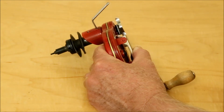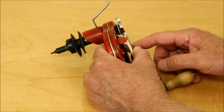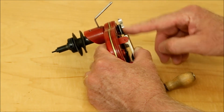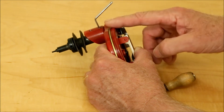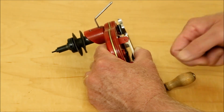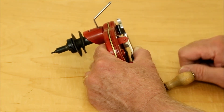The second issue is about the video I made on attaching the hand crank to the Tula. In that video I left the locking lever in this position. In this position the hand crank is engaged with the sewing machine and you can turn the sewing machine with the hand crank, or if you turn on the electric motor the hand crank also turns, which is a little unsafe.